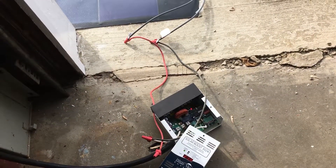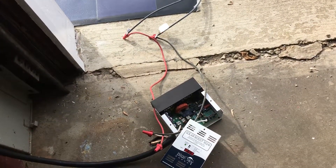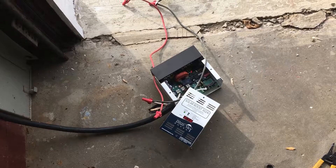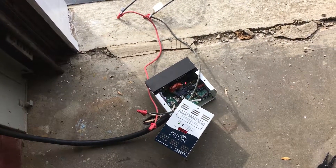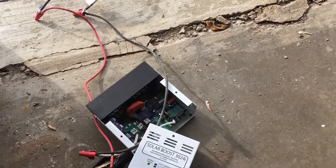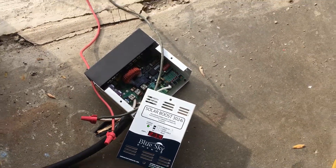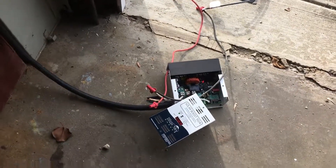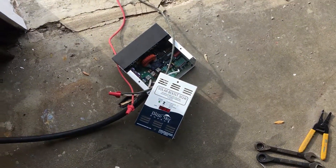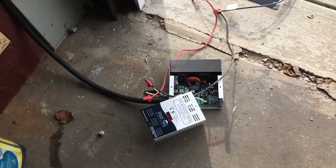The open voltage was 46 and the usable voltage was somewhere around 30 to 33 volts, so they should be high enough. When the controller goes into absorption mode the batteries are something like 29 volts, so the solar panel should be able to get up to 29 volts based on what I've seen. Anyway, just wanted to give a quick video of the new solar panel I got.